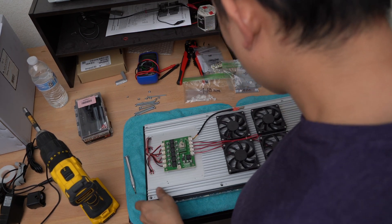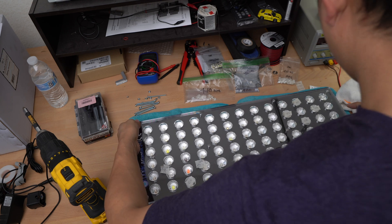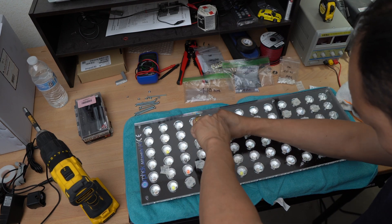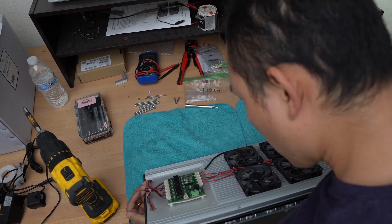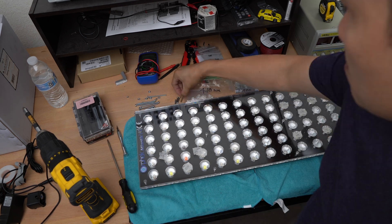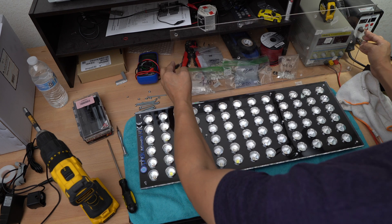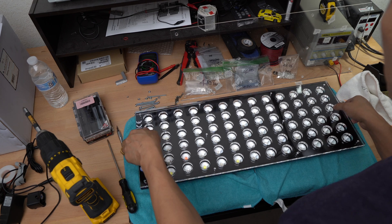The bezel is off and I took this unit to be cleaned up a bit. I used my air compressor to blow out the heat sink and the motherboard. Here I'm working on the front — there are actually four screws on top that you have to remove, and then the whole top acrylic assembly comes apart. You want to be very careful not to scratch the lens itself. Then I'm placing the acrylic top piece in front of my LED light to reuse it, and taking off the metal middle layers and setting them aside.